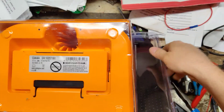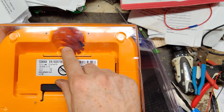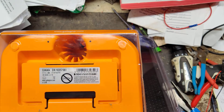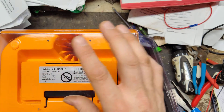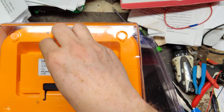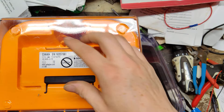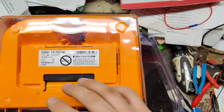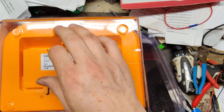It's pretty slick. All the Gallagher solar ones do this now — on the mounting, it can mount two different ways, but the main way people use it is on the bottom, where it slides onto a T-post. There are little teeth inside here and it's got a 360-degree mount to go onto a T-post. It doesn't matter which way the T-post is faced — it can go on there any way you want. Older ones and almost every other brand have a one-way or two-way slot, so if the T-post is facing east and you need to face south, you've got to pull the unit off, yank the T-post out, turn it, drive it back down, and mount it back. This one, it doesn't matter which way the T-post is facing.